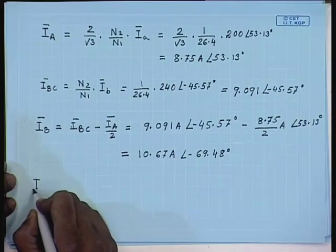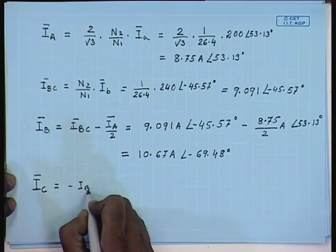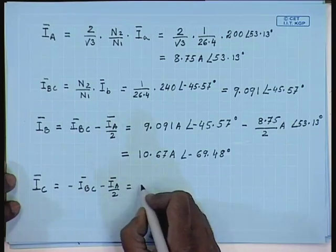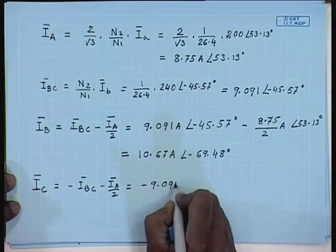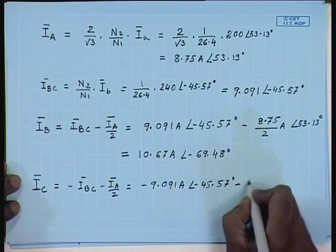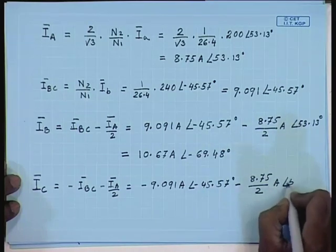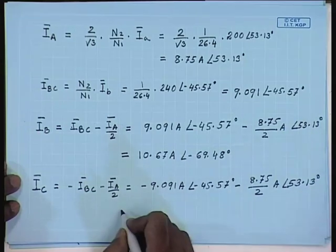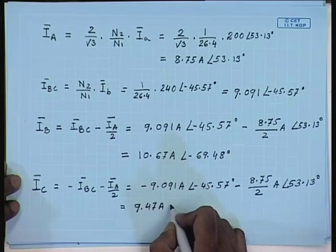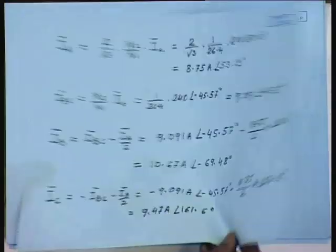The phasor I_C will be minus I_BC minus I_A by 2, that is minus 9.091 amperes angle minus 45.57 degrees minus 8.75 by 2 amperes angle. This comes to 9.47 amperes angle 161.6 degrees. So, if we draw the phasor diagram,